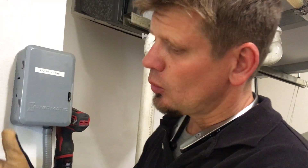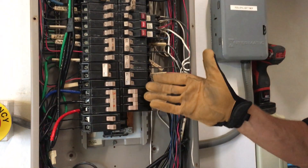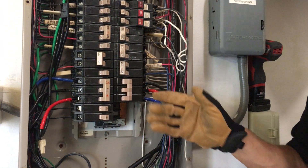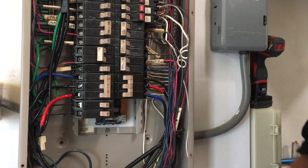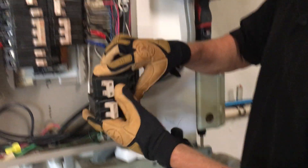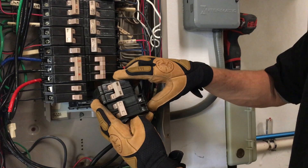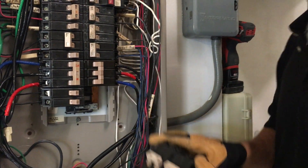Once we did that, we did need to step down to a 50-amp three-pole breaker. Those are a Stab Type CH — you're not going to find that at your normal box store. In order to keep them running, I had these four wires in here: black, red, blue, and one bare.